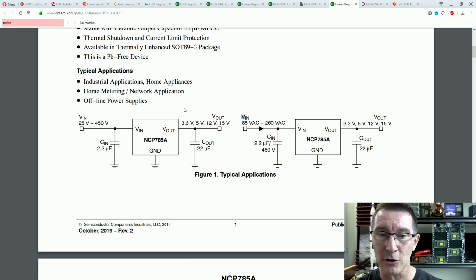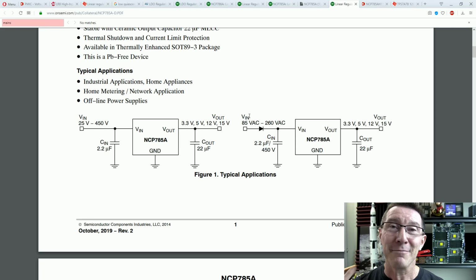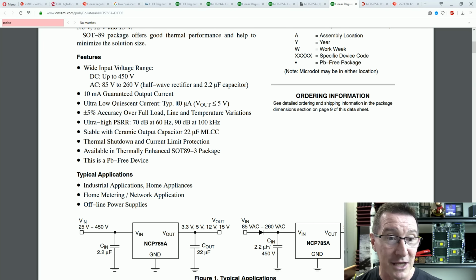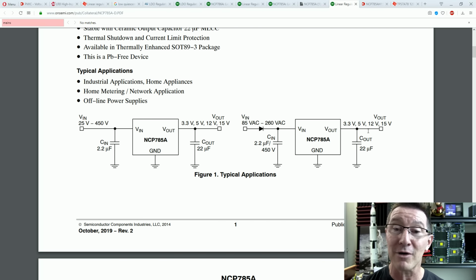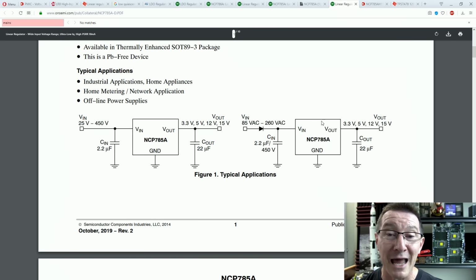It's really quite nice. But still, because you aren't implementing that Zener solution, that's just pissing away like 80 milliamps or whatever. They didn't need it that high. They could have just implemented the Zener diode circuit better. But anyway, these are going to be a better solution because the quiescent current is only like 10 microamps, and 50 microamps for the load. So it's drawing naff all.